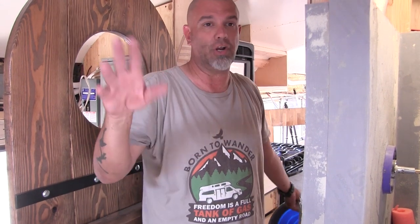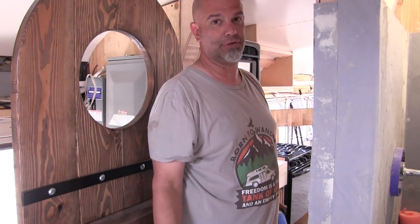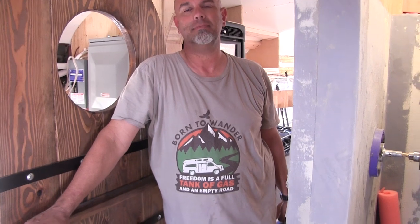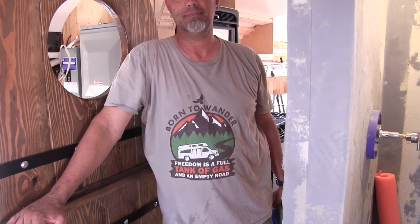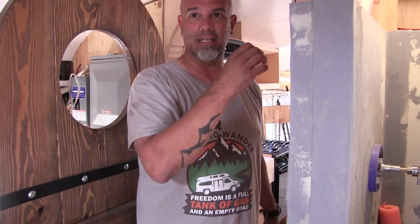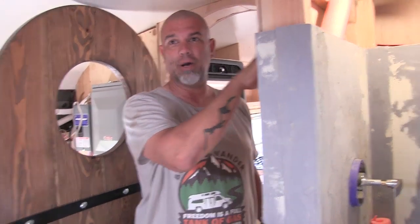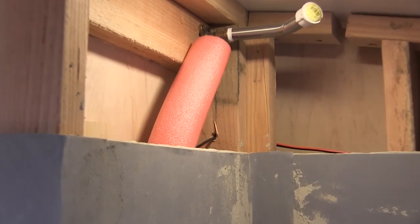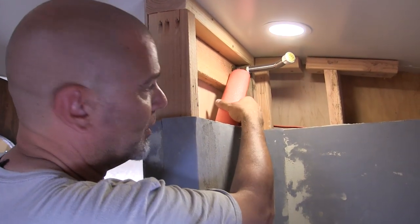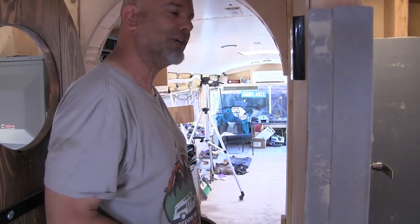And so they just turn on the hot water all the way and take a shower. So that's what we learned from this. That's really good for taking Navy showers too, because if you want to turn off the water to soap up, turn it back on to rinse, it's still exactly at the same temperature. Right, and that's why we put the insulation on the pipes in this wall, so that when we're taking a Navy shower, that water stays roughly exactly the same temperature, or loses a partial degree while we're soaping up or cooling off or whatever. So it's kind of cool.